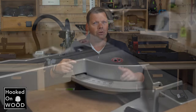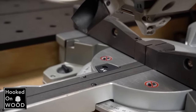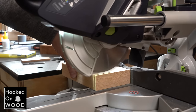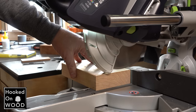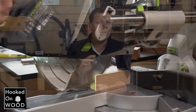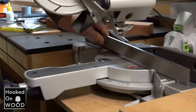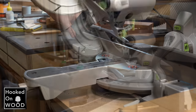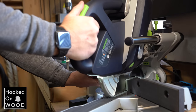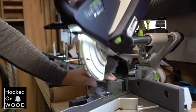I also created an insert at the bottom. Technically this is not a zero clearance insert because the saw blade moves in an upwards direction, so if there would be splinters they would exist at the top. That is why it is good to first make a minor groove on the surface to prevent this from happening. The insert is still beneficial because it creates much more stability, perfectly aligned with the platform. This makes it safer to make cuts in smaller workpieces and nothing will fall in the groove because of the tight cap.